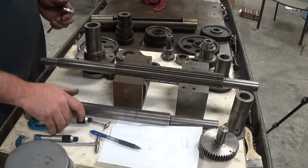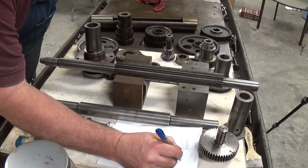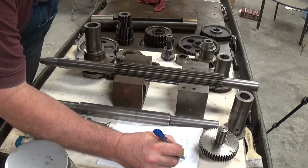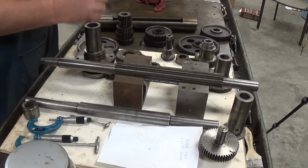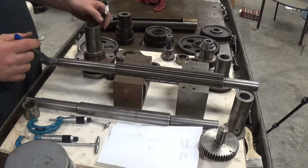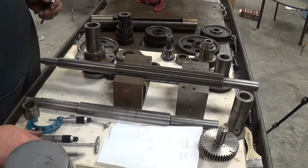One inch, 251 and 4/10. So my second measurement is 1/10 off. Okay, and this one was 1 inch, 252.1. Alright, so I've measured it 4 times, at 90 degrees to each other. And so I got 2 dimensions on the shaft.